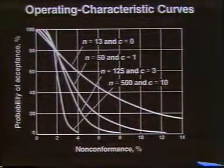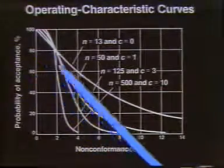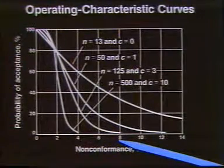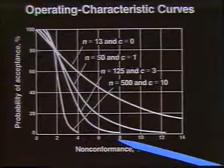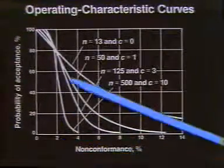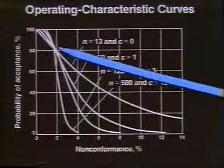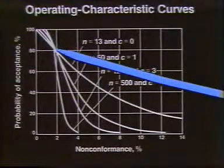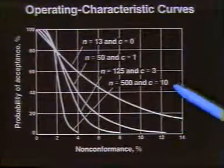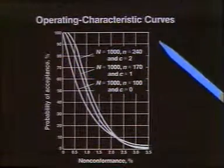And so using such devices, they come up with curves that would be ideal. In an ideal curve, they call it a Z-type curve, we have about the same percentage as the percentage that will give us a probability of acceptance. If we have an acceptance level, in this particular case, of 90%, then if we just took a 2% sample of the material, we would generally always pass the lot. There are a number of model curves like this, and in the next slide we see another type of curve that we could develop.